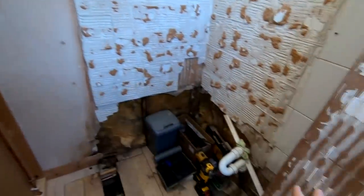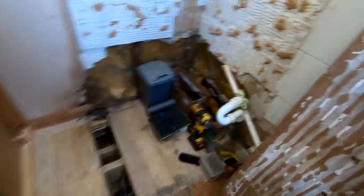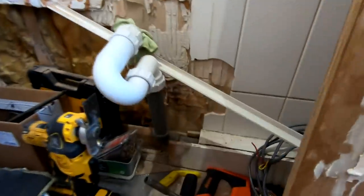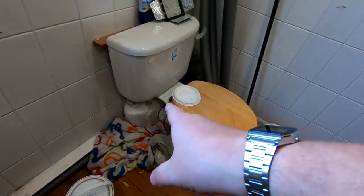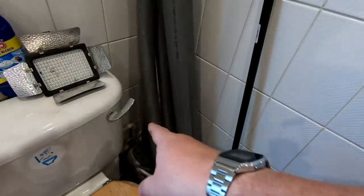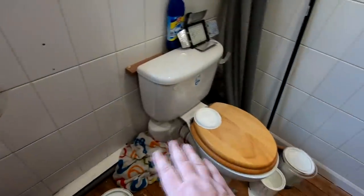Coming into here, it's a bit more organised in here now. I've got most of the floor back and I've got the plumbing in for the power shower, which is going there as you can see. All this is fitted now, fixed. The pipes here coming up - we've got the hot feed going up and the cold feed coming up on the outside. They go right up into the roof space. Above there, there's a platform where the pump's going to sit. These two coming down here are the hot and cold feed - this one's the hot and that one's the cold. This is where the mixer taps are going to be sitting.